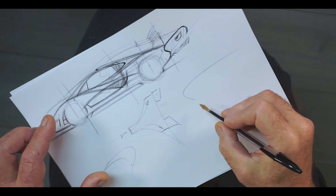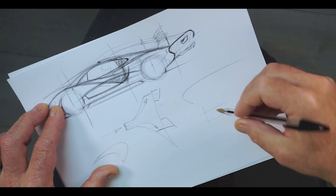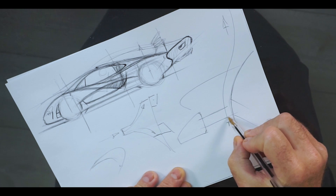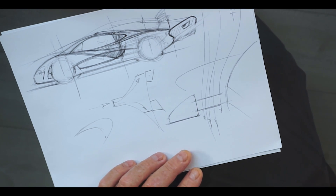When we were testing the P1, we were getting a lot of wind noise coming around the A-pillars off the front of the car at speed — you would hear that wind rush, that sound of the wind buzzing along, which can be disturbing and more so the faster you go. Research showed us the reason: the actual mirror arm holding the mirror so far out required a fairly large arm coming off the body of the car. Looking downward at the mirror housing, the problem of wind noise originated when the wind flow comes at high speed, goes around the windscreen, and then comes over and under the arm that supports the wing mirror.